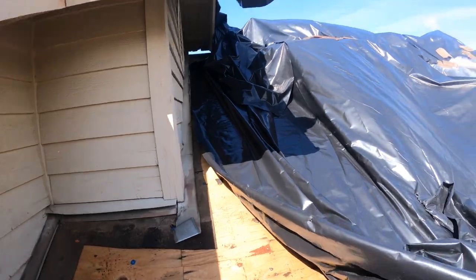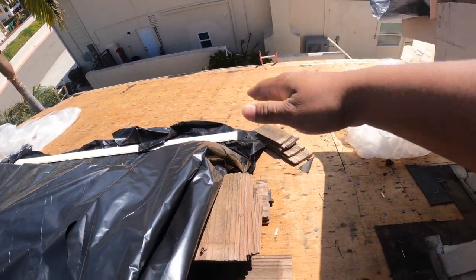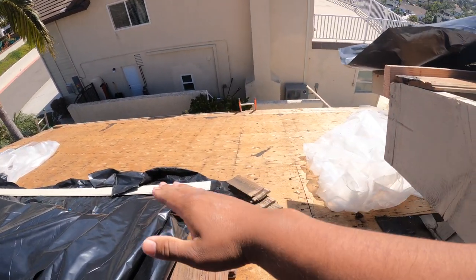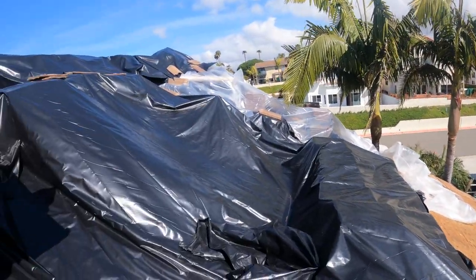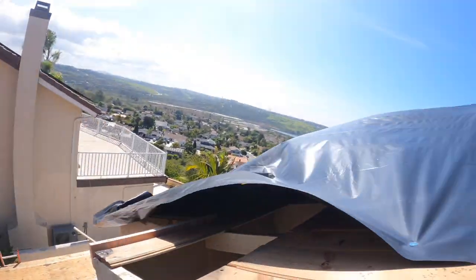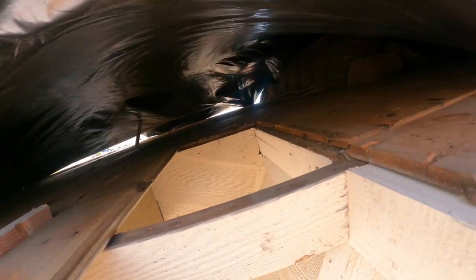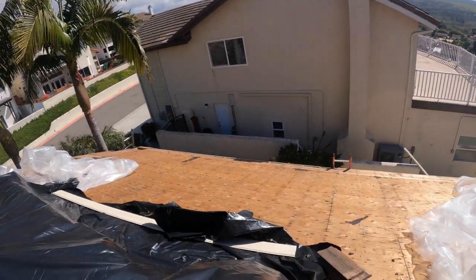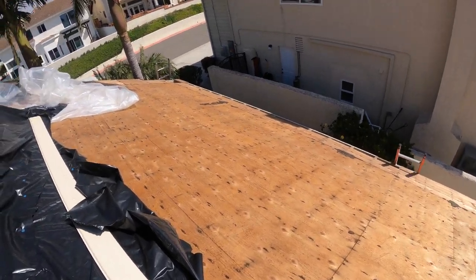So they're tearing off this roof, stacking the tile, tearing the felt off, stacking it, putting the felt down, and then putting the tile back. They're changing the starter board and fascia. They didn't want it to start raining, so that's why it's all covered in plastic. You can see under, kind of. This is all done, pipes, everything's solid. A little bit of wind, but the inspector's coming today, so they are changing all the wood.